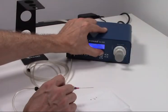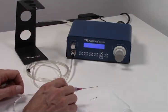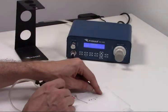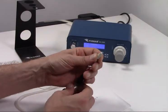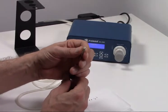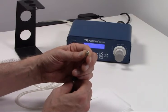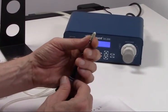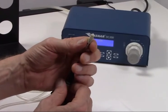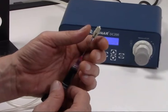When first developing a process, some experimentation is necessary to determine the optimum time and pressure settings for your application. This demonstration uses an 18-gauge needle to fill a standard SC connector with AB 9320 epoxy. We'll need to determine the best time and pressure settings for this combination of variables. First, set the time and pressure to moderate values and try to fill a sample connector. Insert the needle until it bottoms out, depress the footswitch until you see the epoxy bead on the ferrule surface, and then backfill the ferrule. Manually adjust pressure and time controls as needed until you are satisfied with the dispensed results.